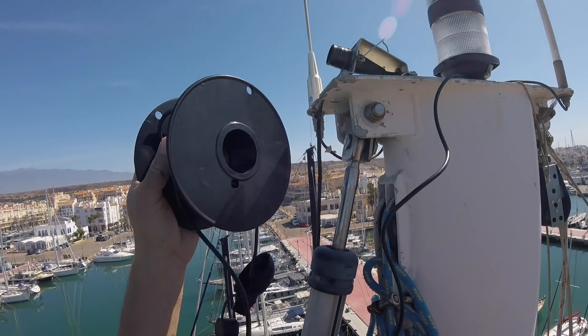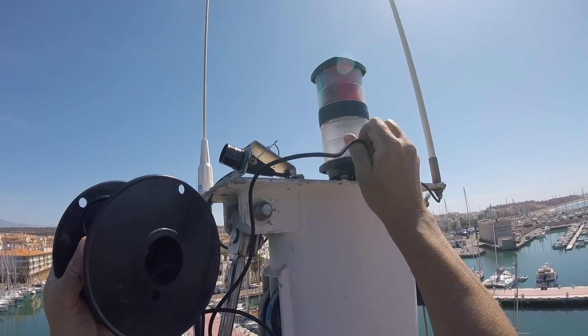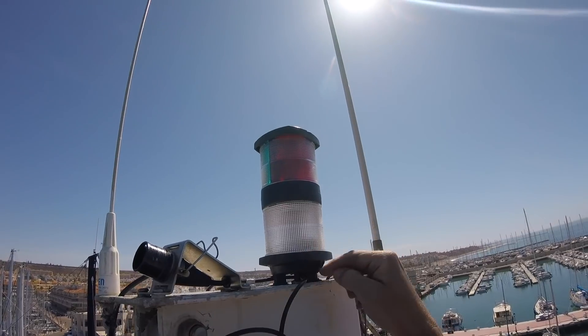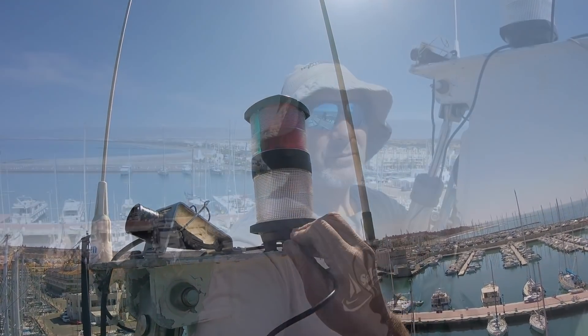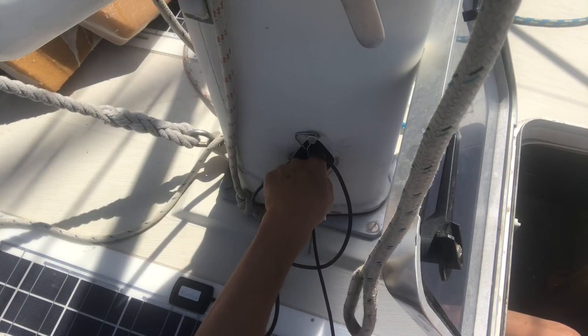This is obviously a two-person job because you need somebody to feed the cable at the top of the mast while somebody pulls it from below. I mounted the tricolor over the hole because that adds a bit of UV protection to the wires at the most vulnerable part, and it also means that the wire can run straight up into the tricolor without being exposed to the outside of the mast. This UV is a killer up here. There's a really strange u-bend at the bottom which is very compact and very difficult to get to. We're just having a few problems getting that masking taped end around the bend — it's going to go down, up and down again. But at least we've got the wire through the mast now.